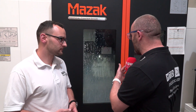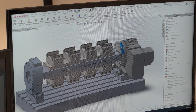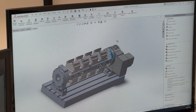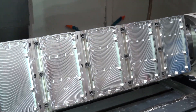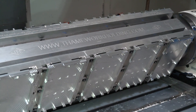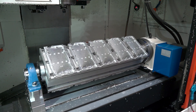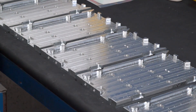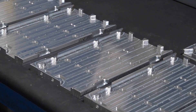So what was the solution? I know you've gone for a trunnion system, but there are lots of different trunnion systems — why did you go for this one? That's actually my design. Some workholding help confirmed everything was going to work. We are using four double quick-point plates on the trunnion, plus front plates where the trunnion is actually located. The beauty of Lang is with the pull studs you can put anything on there, provided it fits — you can use the pull studs for any kind of billet and use the same location.